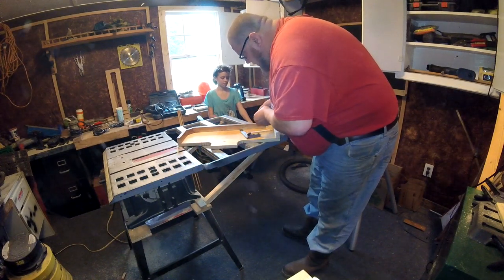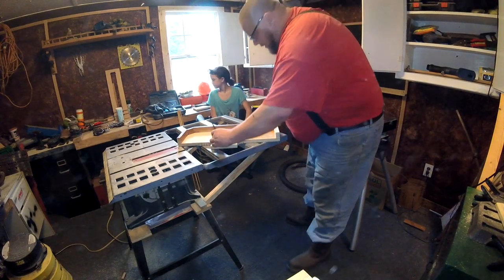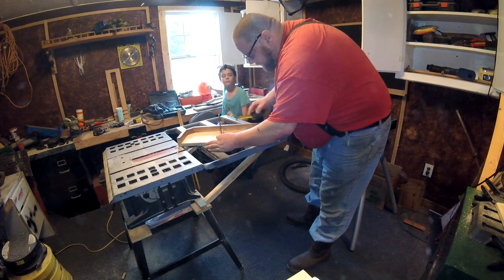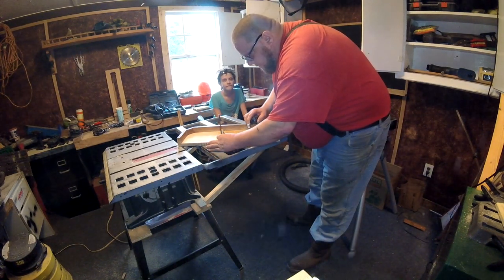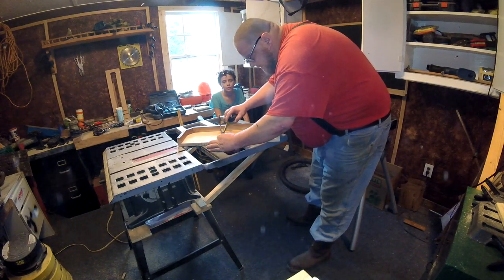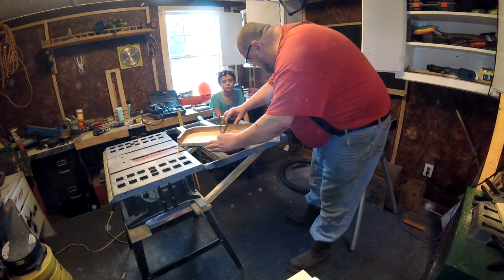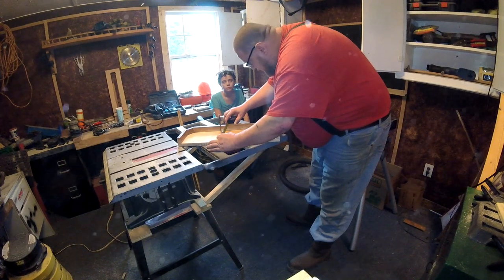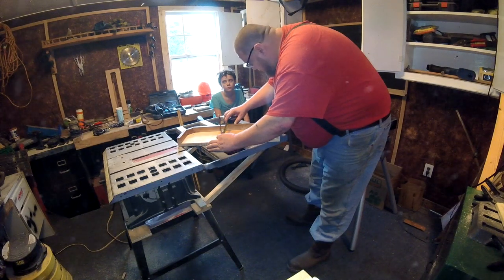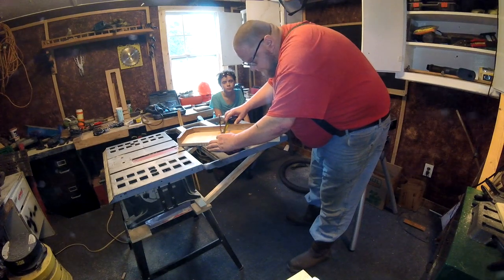Right, now, look here. I'm going to hold that right there on that mark, because I need to measure to the outside. I need to be able to measure up here. So 7 9/16 is what we need to set our saw. Let's go ahead and make that 7. No. Right there. 7 1/2.